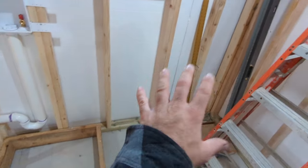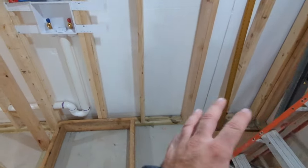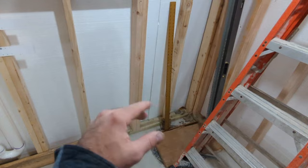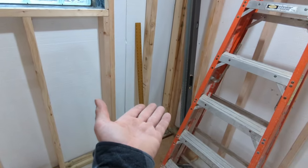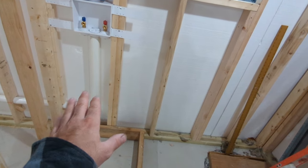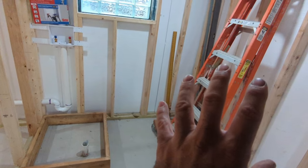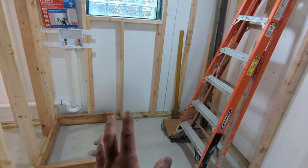So anyway, the sink often won't be used here. It'll be here if somebody needs to wash their hands or do a little work. So the other thing is, when it sits there and you're not running water in it weekly, if it's really dry and you're literally running dehumidifiers in a basement all the time, that dry air can dry out the trap, and the suction. This is why it doesn't meet code, because of the suction. Long story short, between the two things, you're going to genuinely have a problem with drying out your trap and all of that. So you can't do it.